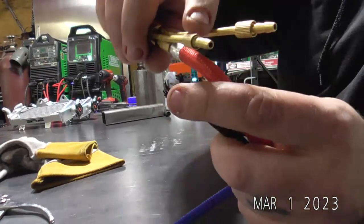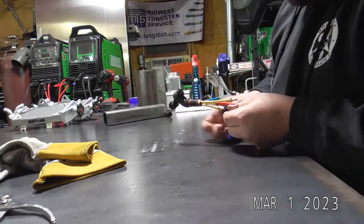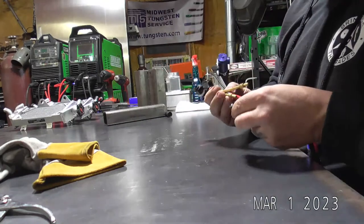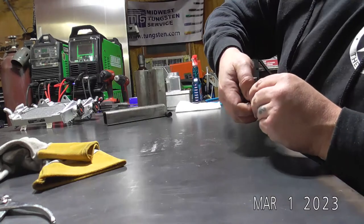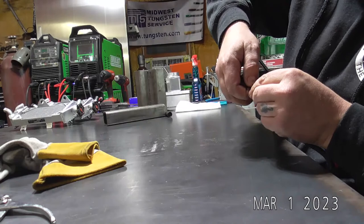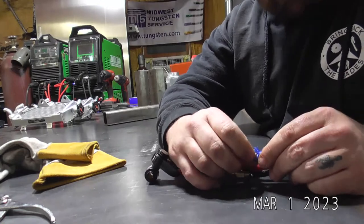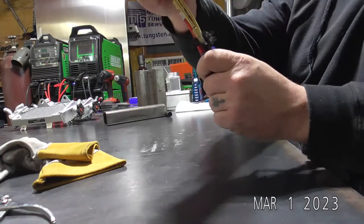So we just have it hose barbed with this little threaded ferrule. You just literally thread it up there, and just run that ferrule down. I threaded that out a little bit too far, so now I gotta mess with it. There we go. That ferrule will go over the end of your torch line and seal it. Just do the same to the other line. And I always like to apply a little pressure pushing them together. There you go. You push those back together nice and tight.